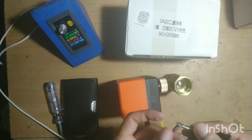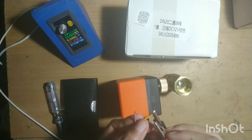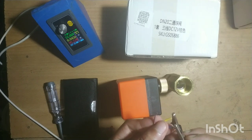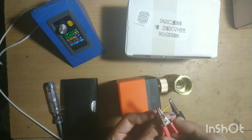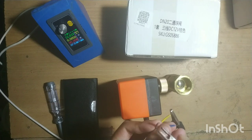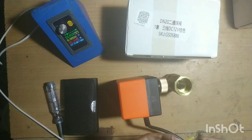Let's put the black wire on yellow. I am touching the blue wire — the valve is opening! Now the valve is fully opened. If I touch the brown wire, the valve will be closed. Now again if I touch the blue wire, the valve will open.